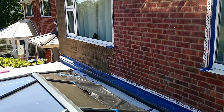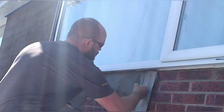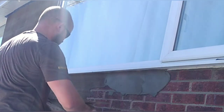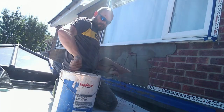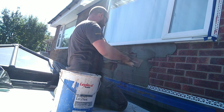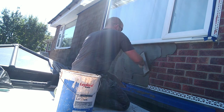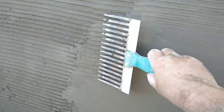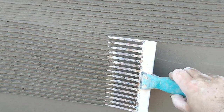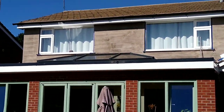As mentioned, the temperature of this wall is quite warm — still warm where the Sun was on it. Normally on a cloudy day I'd hose the wall down and follow the scratch coat on with no dramas, but I'm very conscious of the temperature and the humidity being really high. So I've been hosing down every meter — basically putting a meter on, scratching it up, then hosing down the next section and continuing along like that. The goal is to retain moisture in the mix so it doesn't dry out too quickly.